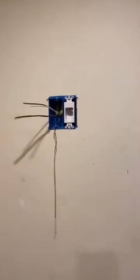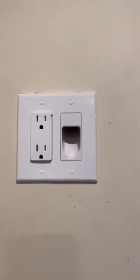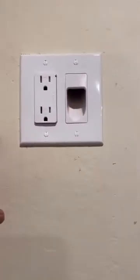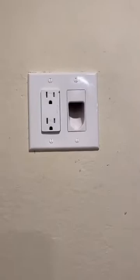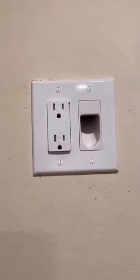Take a look at this — this part is done. Of course I still have to paint the walls, but this is a tamper-resistant, also surge-protector outlet, because this is where the TV is going to go. The TV mount is going to be here somewhere. And this is just a simple pass-through for the low voltage when I pull the low voltage, if I even need it. But it's there if I need it, and later if I want to make it permanent, I can change this to either an HDMI or an internet connection, or just leave it as a simple open port for a pull-through. Definitely recommended to put a surge protector, especially in Florida.